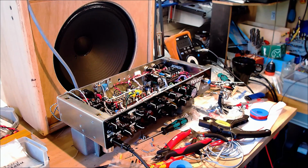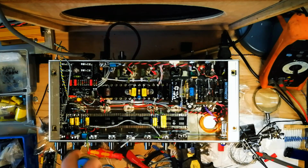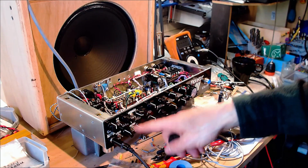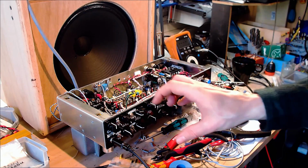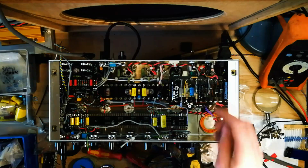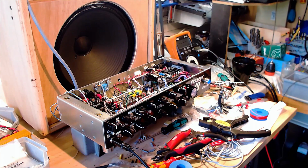So my clean channel sound is ready. The equalizer is not built up yet, but the first 2 triodes, as you can see with the camera up here, are finished. And I've connected both master volume, but the gains are separate gain settings and equalizings for the preamp that I'm going to use on the actual complete amp. So we can make our first sound check. Where's the volume down? I also upgraded my later chassis with a Vintage 30 Celestion speaker, as you can see.